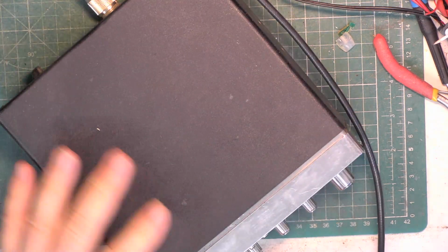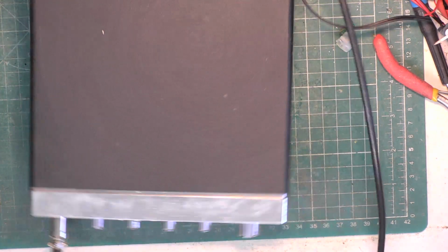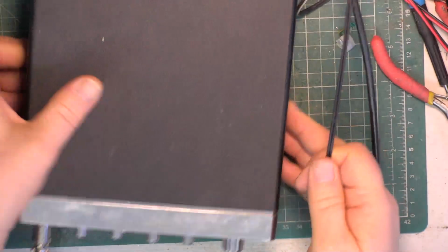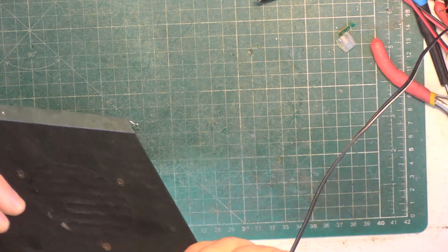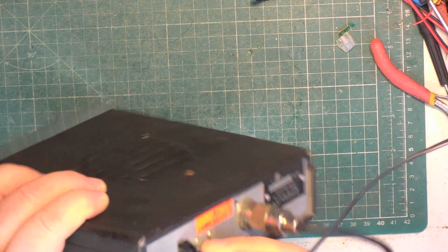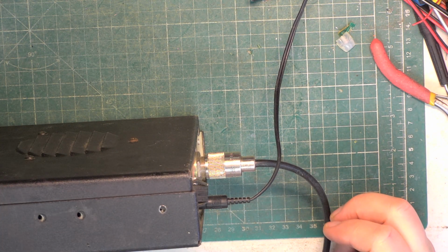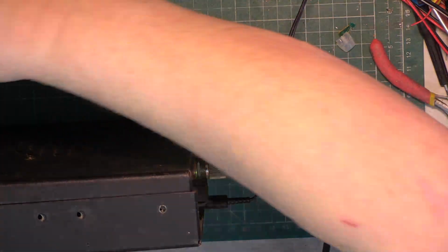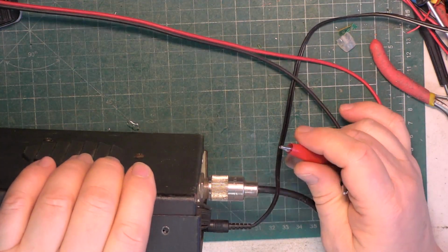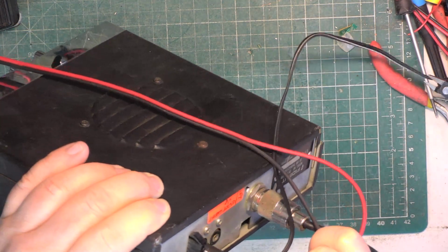So, it just lights up, says Mark. So we'll put a standard replacement mic in. These are prone to being destroyed by incorrect polarity, and it destroys nearly all the ICs. It's very expensive to fix. We'll go in with the cigarette lighter lead. We won't. We don't have cigarette lighter leads. We will go in with the crocodile clips. We have new leads available, which Mr. Chippie makes with the correct mouldings, not pretend mouldings, ones imported from the United States.